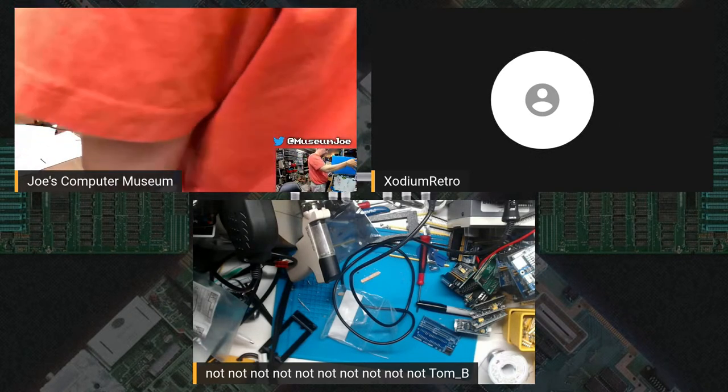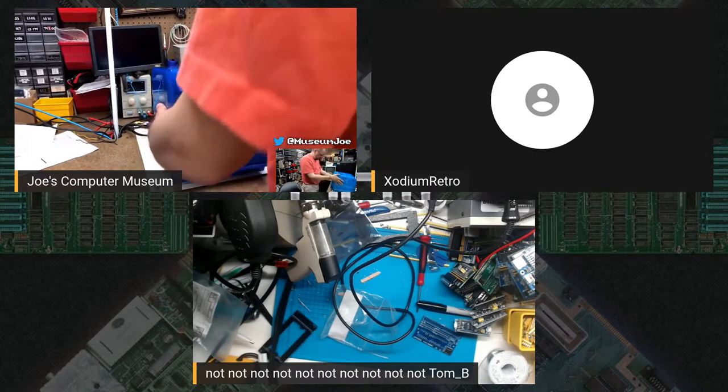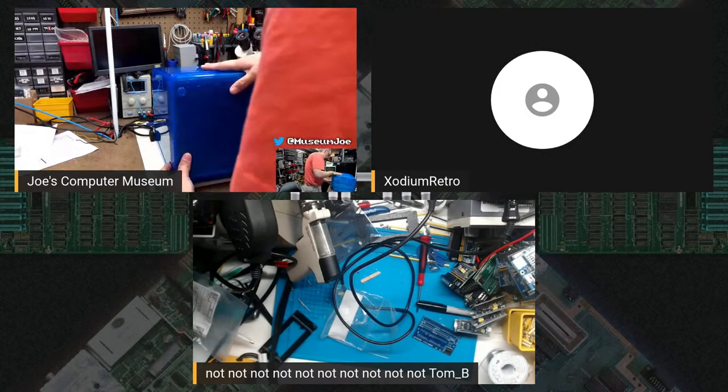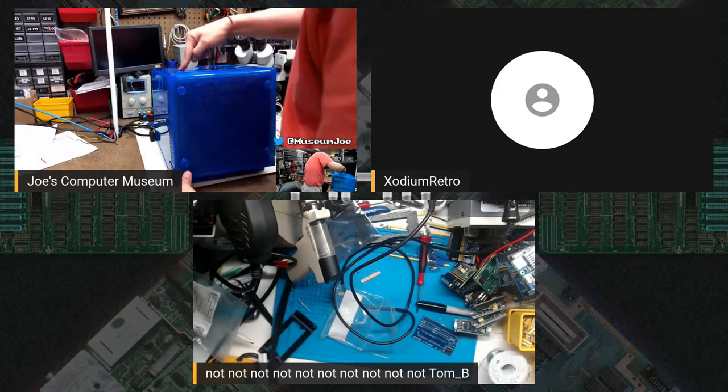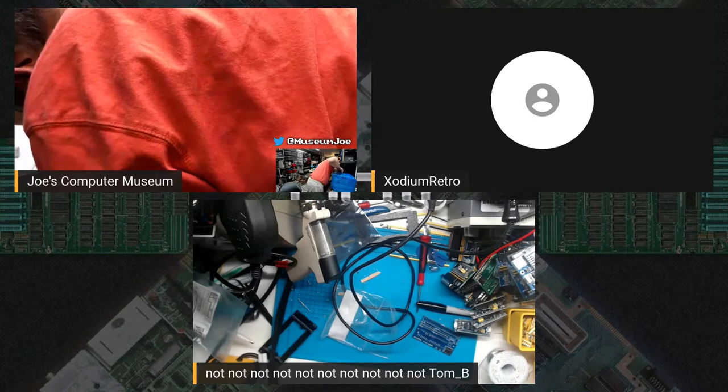What is this LED you threw in with the RAM kit? Is that supposed to be the bezel bulb or whatever? Yeah, that. It's cool. It's a two-color LED, so you can hook it up to your blue SCSI and have one color for power and one for activity. What I've seen it put into is the Color Classic, where it just has a power light normally. So you could have green for power and then it will flash red when there's disk activity.